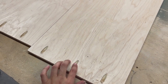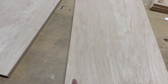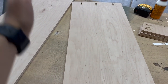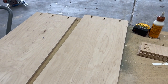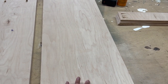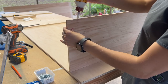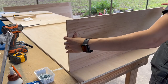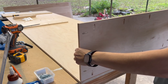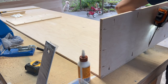Here's the silly mistake that I just made — I made pocket holes going along the shorter end, but this is going on the side of the cabinet, so my pocket holes should have gone on the sides since the sides of the cabinet are here, not up here; these are the front and the back. Mistakes that I make so that you won't make them — things don't always go perfect, but you won't be able to see it. I went ahead and made pocket holes where I was supposed to. I then attached the top and bottom with pocket hole screws and wood glue. You don't necessarily have to use glue, but I don't intend on ever taking these apart, so I chose to use glue as well.